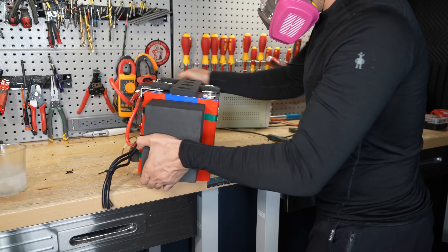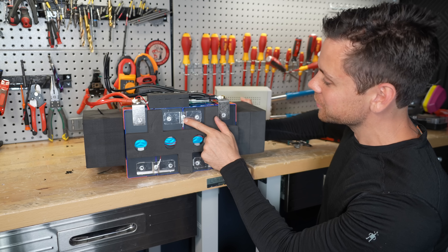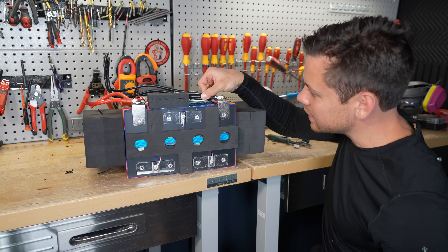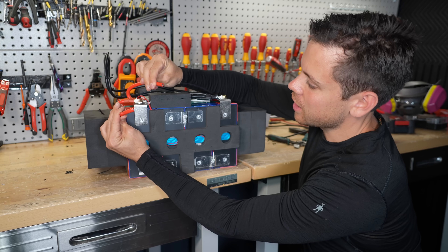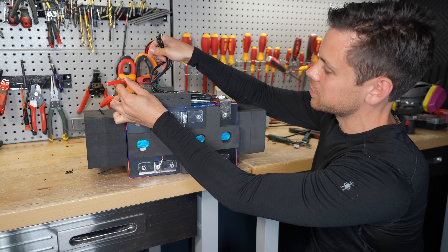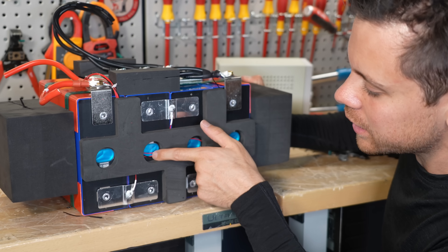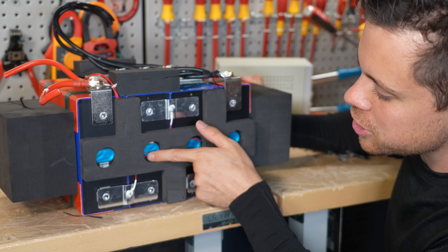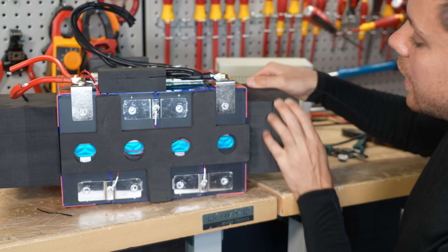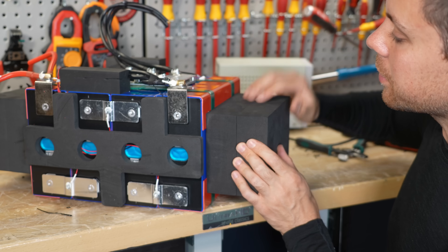The overpressure relief valves are not obscured. We have screw terminals on the bus bars, and we also have the lumps so they can expand and contract. The main connections are really solid, though a little small for 200 amps — technically with this insulation type it can handle it, and the screw terminal side has more conductors which is nice. But I don't like this balance cable — they're just glued down under foam. This should be separated and protected. There's insulative material between the cells and they're strapped together with strapping, not tape, which is pretty nice at this price point.